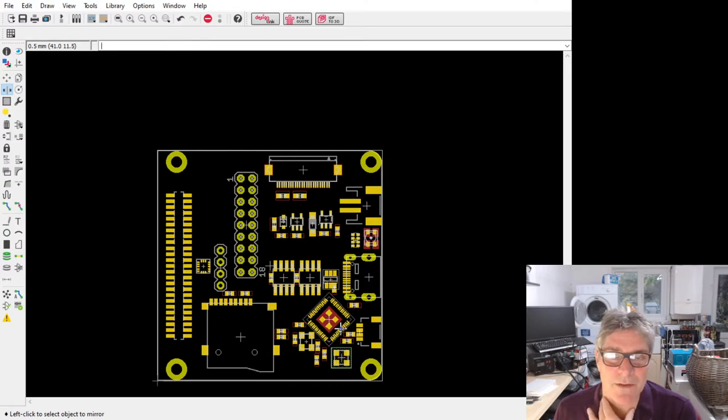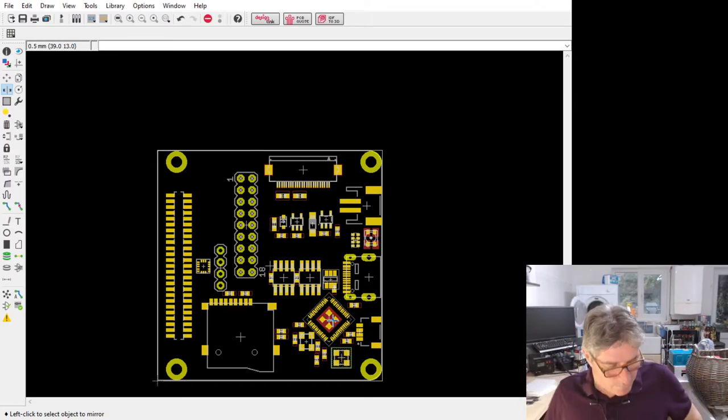The good thing about using the ESP32-S2, by the way, is we've got the CircuitPython support already, including all of the networking and Wi-Fi libraries. So that enables us to then talk to the robot whilst it's running without having to have cables plugged into it.